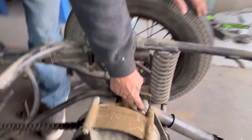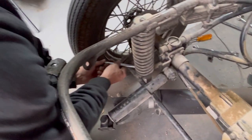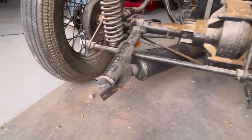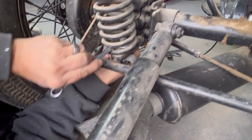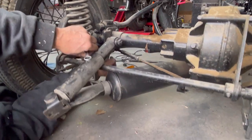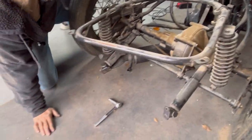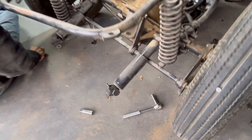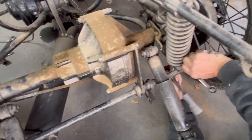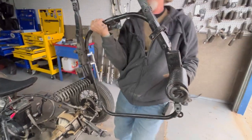Down here on the shock absorbers, those are rubber bushings. There's a lot of stuff this old machine needs. Keep watching as we keep tearing it down — coil shocks are coming off. These are stuck down in there. There's no easy way to do some of this stuff. Got this bolt and one more, and I should be able to pull that subframe completely off of here. One disassembled subframe. Hey, look — there's a wasp nest. I'm hoping it's cold enough I don't get wasp-bit.